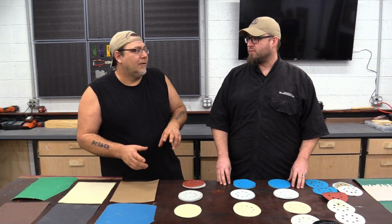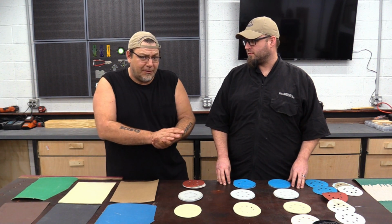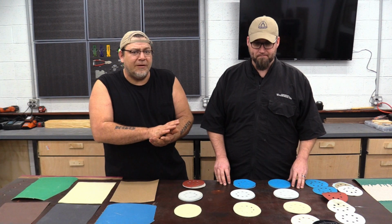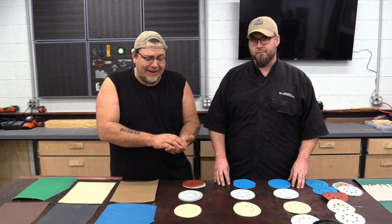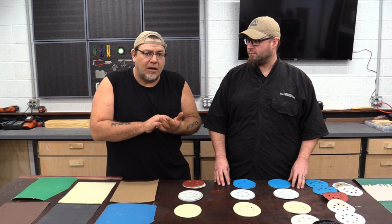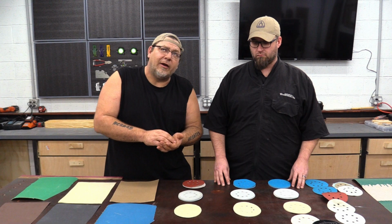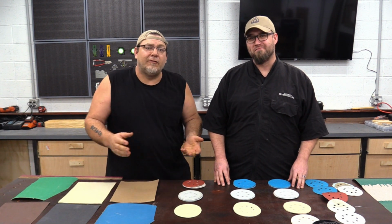So you're losing mechanical bond to the wood of the finish, and that's part of the finish process. There's chemical and mechanical bonding. You're losing mechanical bonding of the finish to the material that you've just sanded, which means the finish life will not last as long. How did I say that? A lot less longer? It is a lot less longer. Yeah, it won't last as long.